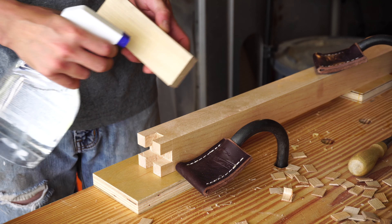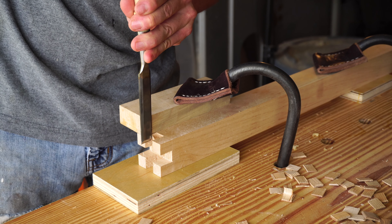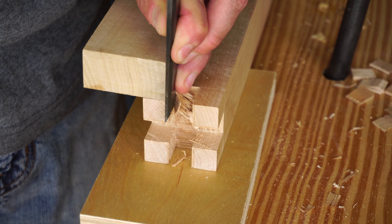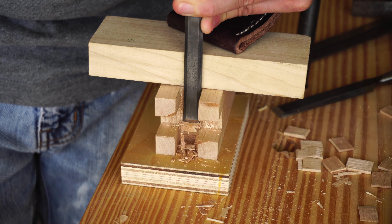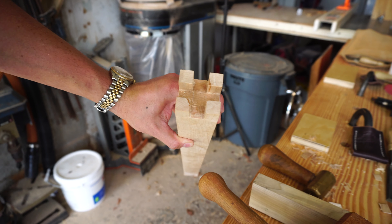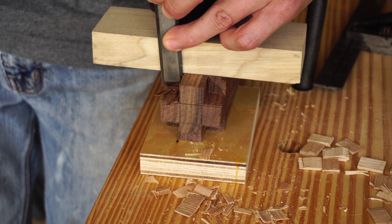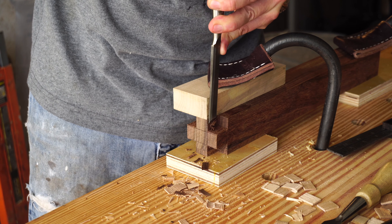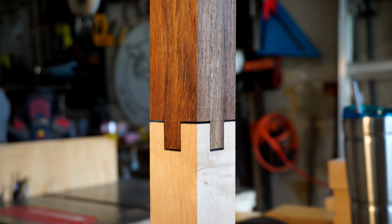To fine-tune everything and keep my 90-degree jig from sliding, I learned this trick from Delaney Lacuni where you can spray the bottom of the jig with water before clamping it to your surface. Then it's just a matter of working your way lightly down to your baseline. When working the base of the mortise, again work halfway down and rotate to protect your faces. The tenon portion is similarly pared down from all sides, and there is something oddly satisfying about watching a very sharp chisel just eat through end grain like that. From the pre-glue test fit, we are snug as a bug in a rug.